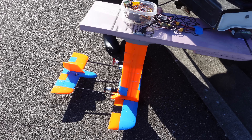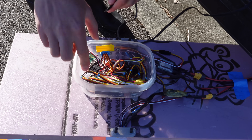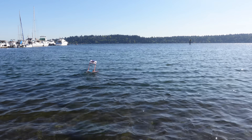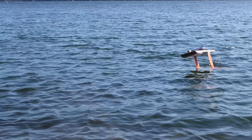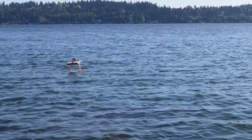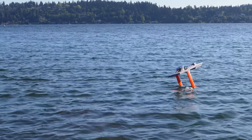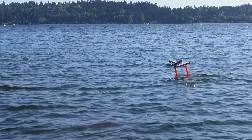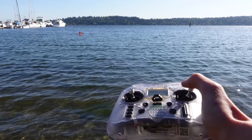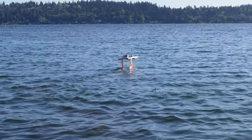For those interested in the control dynamics, I'm going to go back and show all the tests and experiments I did along the way. I just turned up the proportional gains a lot on the roll and pitch — it's pretty hands-off and works super well, really stable. I think there's some SWATH hull effect going on. The altitude almost feels stable; it should be technically unstable, but if there was no buoyancy in the masts it would be unstable. It does a really good job holding altitude by itself with very little elevator or throttle input. I'm going to try and build up some speed — okay, now we're going really quick.